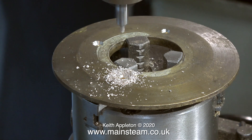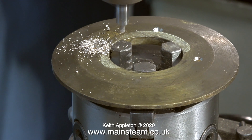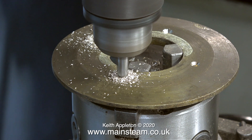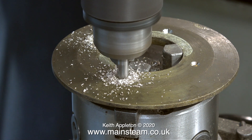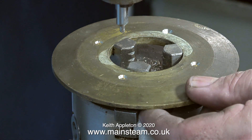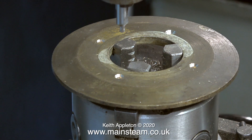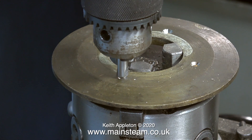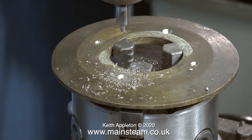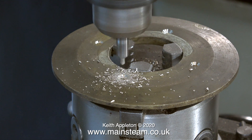I need to drill four holes in this brass ring to mount it to the aluminium part featured in the last episode. I first set the rotary table to zero degrees — it isn't a digital readout, just graduations marked in degrees around the edge of the table. Low down and fastened to the base is a pointer, so you just align the pointer with the number of degrees you want.